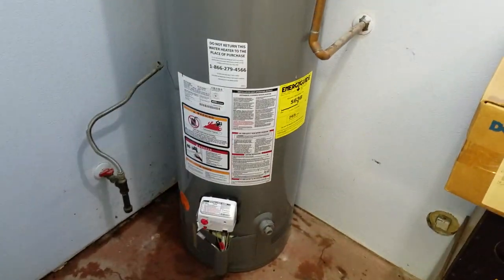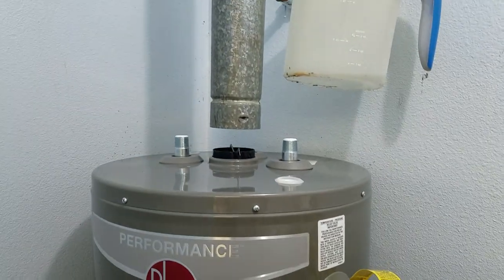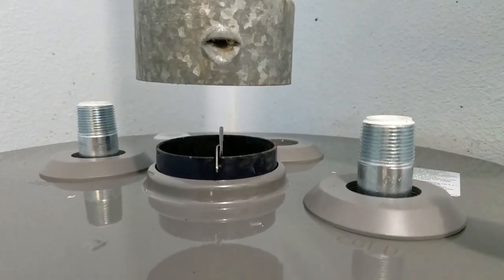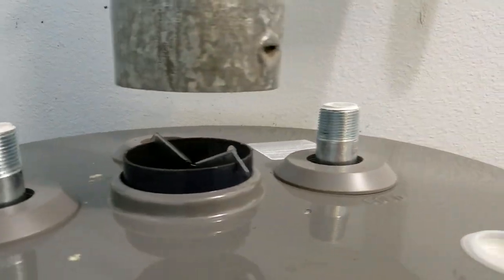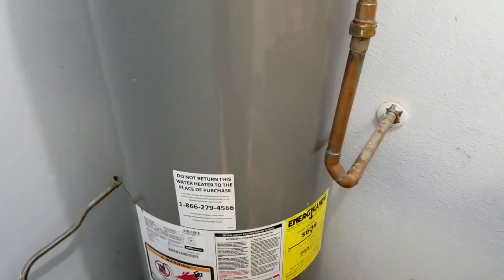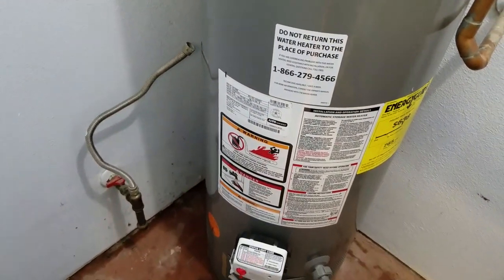So I have the new unit in place, kind of mocked up. I've got the overflow mocked up — it's on a slight angle and I'll work on that. I've got the chimney pretty much lined up. Now the inlet and the outlet aren't in exactly the same position as the old one, but I have flexible copper tubes that I'm going to hook up and fashion in. I think my next worry is getting the chimney installed. I used this piece here as a reference point when sliding it in, and luckily that all lined up pretty good. So I'm going to save the gas hookup for last.